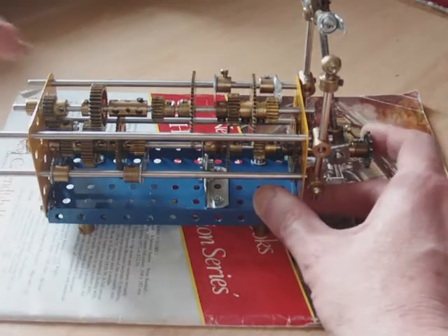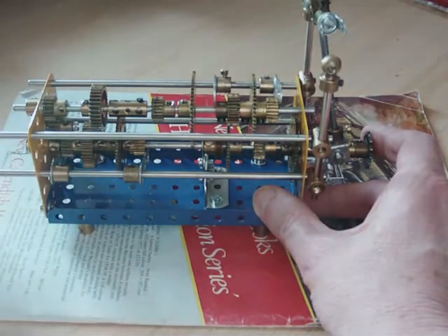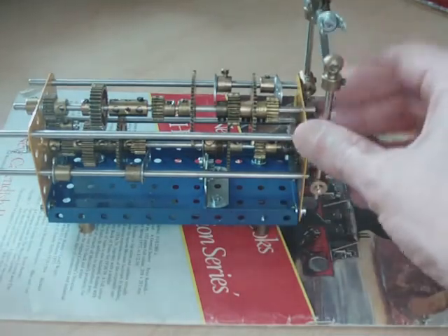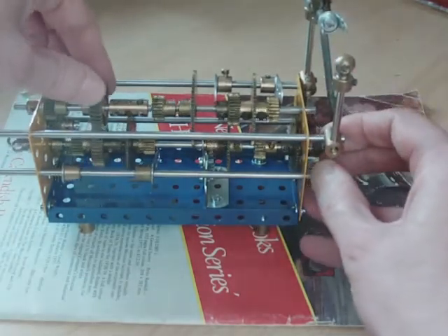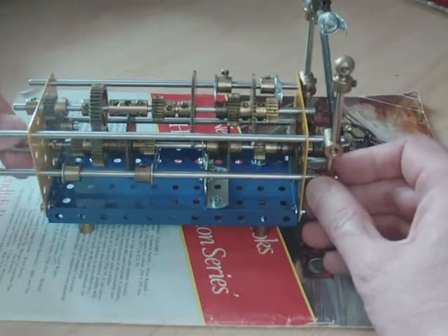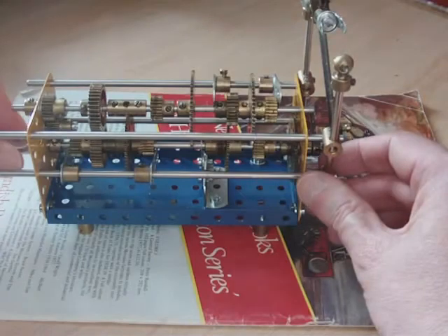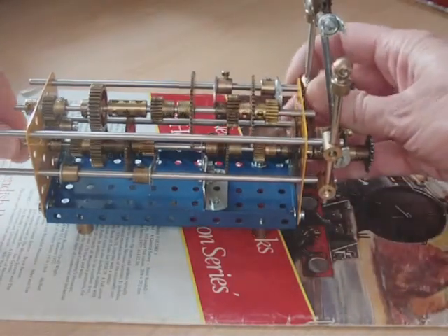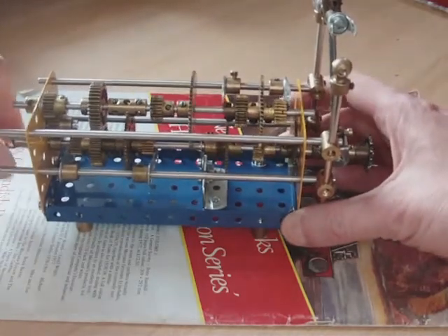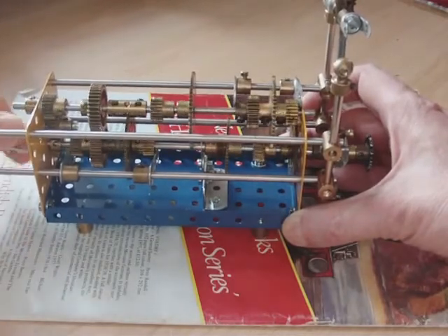At the moment it's in reverse gear. There's an idle pinion here — I won't show that. The first forward gear is there, so that's a 1-to-1 ratio. If I turn that, it now goes down on that gear for a 2-to-1 ratio. Move that across a bit and we get a 1-to-3 ratio. And finally there's a 3-to-1 ratio.